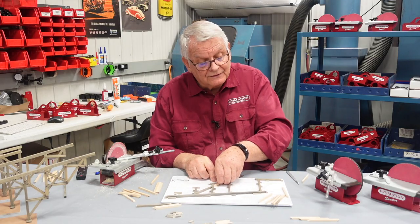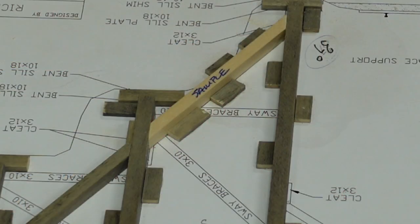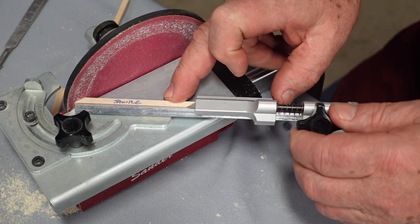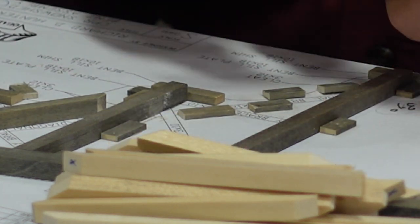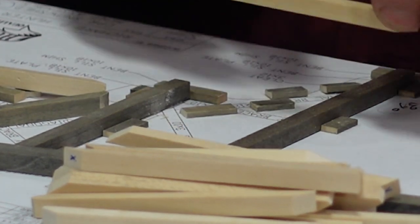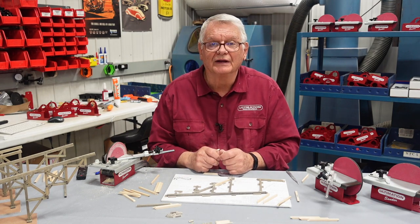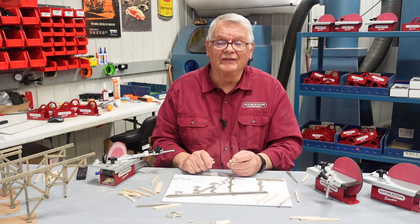The hard part's done. We take that, we mark it. I wrote 'sample' on it so you don't get confused. There's the sample. Now we put it back in the machine just to make sure the machine is set properly. Then we can continue to make numerous pieces. We can take any one of these diagonal braces and find they're all exactly the same. Now you can go ahead and make forty-four, 144, or if you want to build a trestle halfway across the basement you can do a thousand. The machine is set and they can be done in no time.